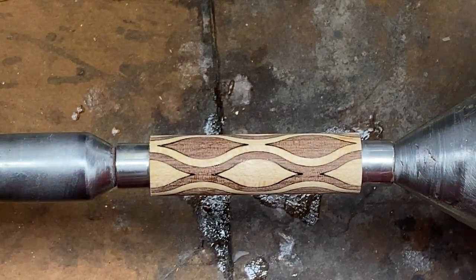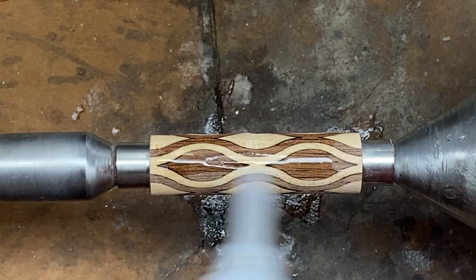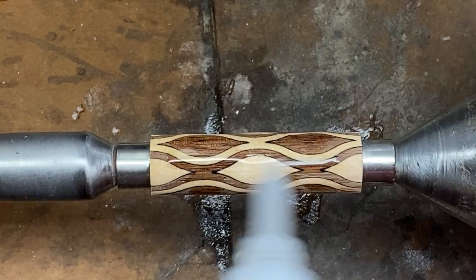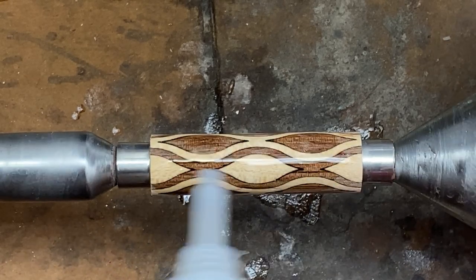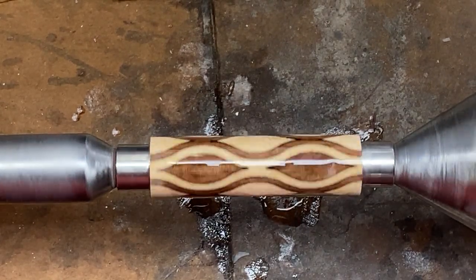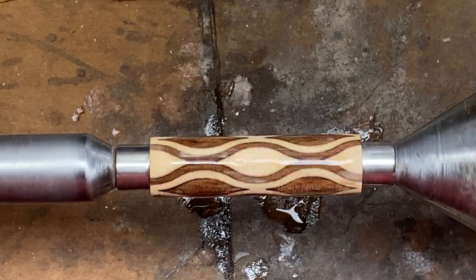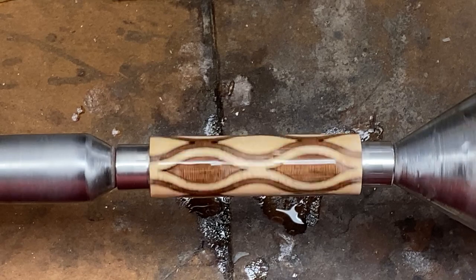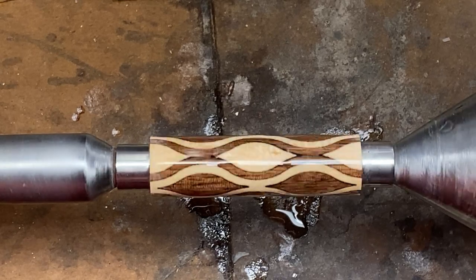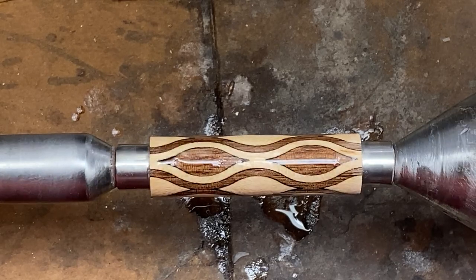Let's get to turning this blank. Prior to turning all laser cut blanks, we're going to give this a quick coat of thin CA. You can see how easy this is — it goes on nice and quick, nice and easy. I'm just going to rotate it to keep that CA rolling around the blank and covering the entire surface. After about 60 to 120 seconds, the blank will start looking dry in areas. I'll hit it with a quick shot of activator, and we immediately begin turning our blank.